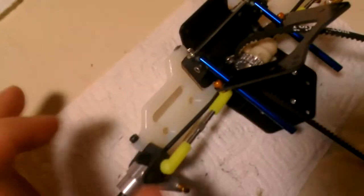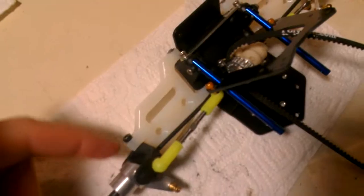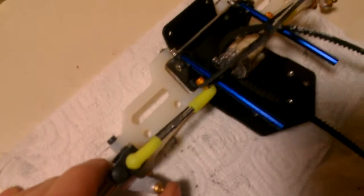On the outside, I didn't really have to change much because I'm not using a hinge pin here. I'm using a screw. I'll get to that in a second. But what I did have to do was take a router bit and sort of sharpen off the inside corners of the opening at the front and the rear of the opening as well.